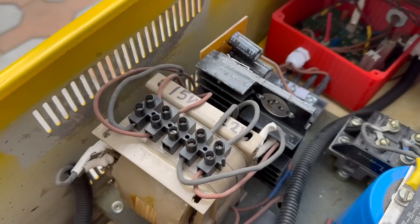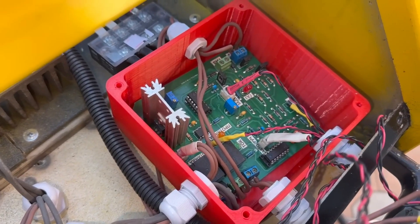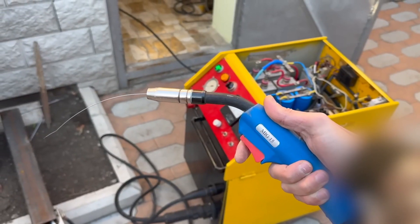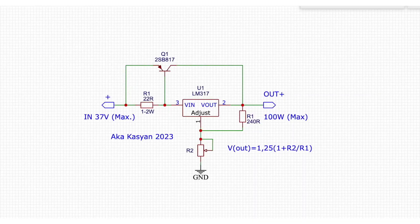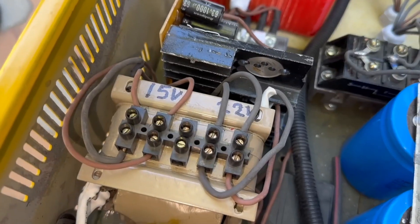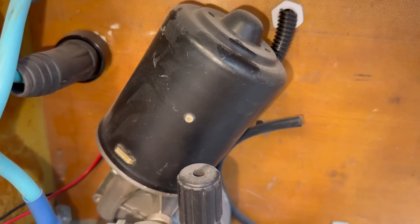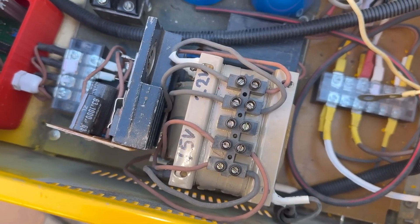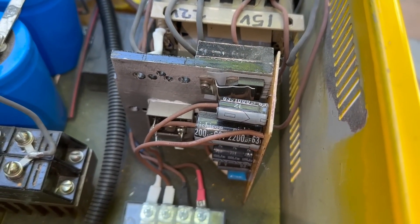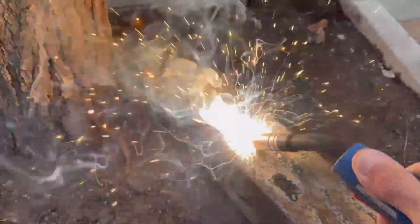The linear stabilizer works perfectly, but it is the one point worth changing. The 24V from the stabilizer is supplied to the control board, which has a PWM regulator responsible for powering and adjusting the motor speed. Why not regulate directly with a linear regulator? At low speeds there will be a lot of losses, so this combined solution was used. The reason for keeping the linear stabilizer at all is that initially I wanted to realize a stabilizer of turns with power maintenance, but gave up on that idea. However, to ensure the motor speed doesn't decrease depending on the weight of the reel and other factors, powering it from a stabilized voltage is better than a PWM regulator with no stabilization at all.